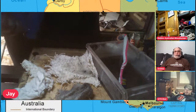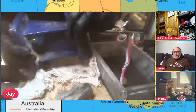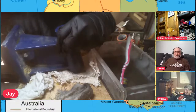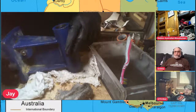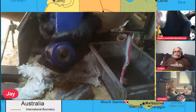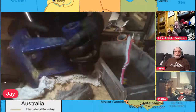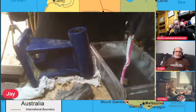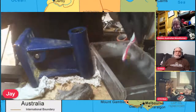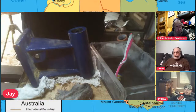The other thing I always check on, and I don't know if your robo is going to have you do it, but when you turn the tailstock over, make sure that the bottom of it is really clean and smooth. That was the first bit I cleaned. Yeah, because you want it to slide easy. If it has some slight ridges or something, that'll pick up the dirt and everything and make it harder to move back and forth.